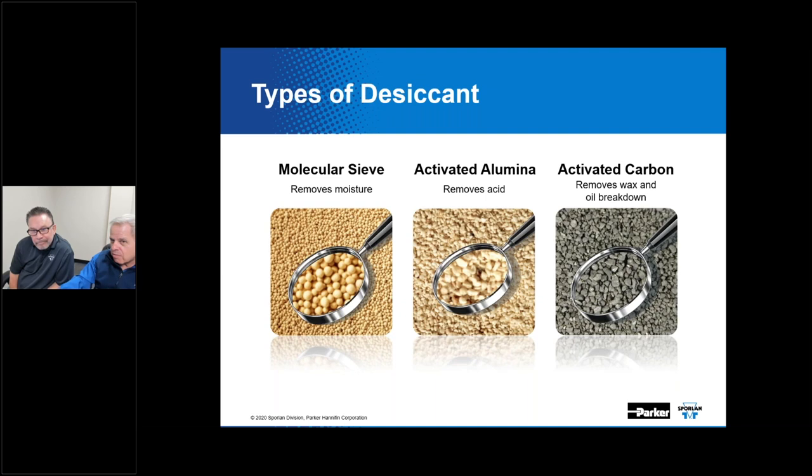That usually comes up because you've got a filter dryer that is being sweat into the system oftentimes. A lot of times people will want to install that out at the condensing unit, right? That's where you see them a lot of times, Kevin. We'd rather see that filter dryer right there at the inlet of the evaporator where the expansion device is located, so that you've got good protection for it there. I don't know the exact point at which that epoxy powder coat starts to deteriorate due to heat. I know that it is certainly compromised by the heat from a flame on a torch.